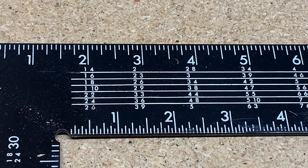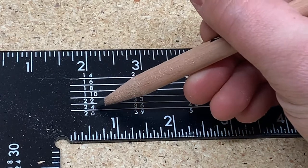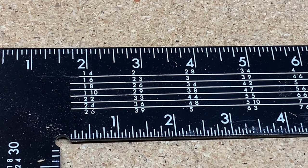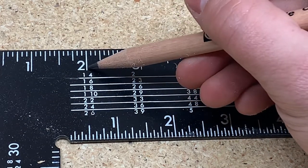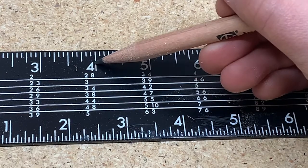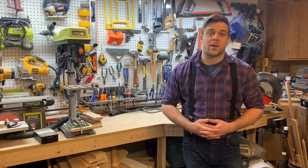This table can also be used to help with some basic math problems. The lines on this table represent 8, 9, 10, 11, 13, 14, and 15. Don't ask me where 12 is, but when you look at a number of inches on the blade of the square, the numbers below tell you how many feet and inches you get when you multiply that amount of inches by the number of the table line. So 2 inches times 8 gives us 16 inches, or 1 foot 4 inches. 4 inches times 10 gives us 40 inches, or 3 feet 4 inches. So this might help you avoid busting out your pencil or calculator to do some quick multiplication with inches.